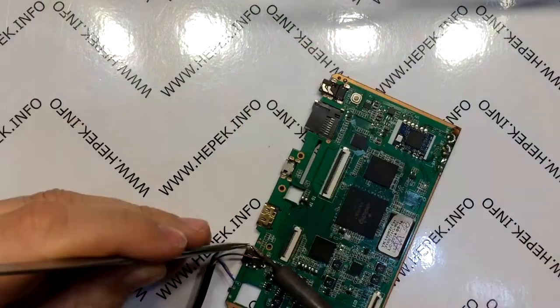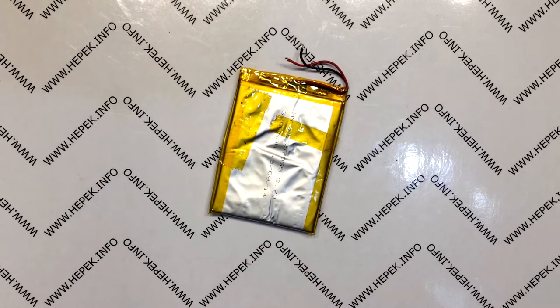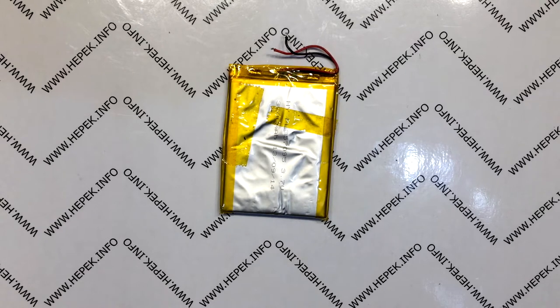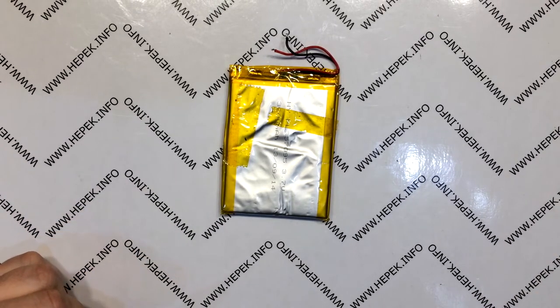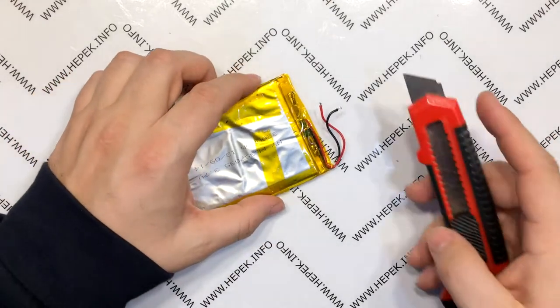I desoldered the battery and the soldered wires on the charging connector. Since I'm giving up on powering it over the 2.5mm DC connector, let's go back to the battery connector. Since each battery has some electronics on it — in most cases that electronic component protects the battery from overcharging, controls charging, power and temperature — I want to remove the electronics from the battery to possibly trick the device into thinking a real battery is connected. I use an ordinary razor cutter and carefully cut the tape, being careful not to pierce or puncture the battery cell.